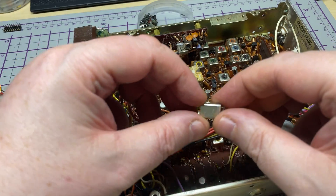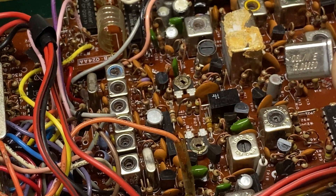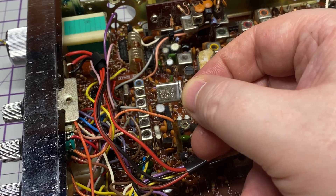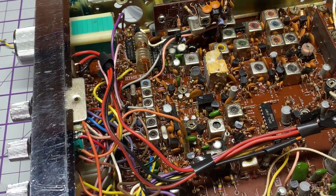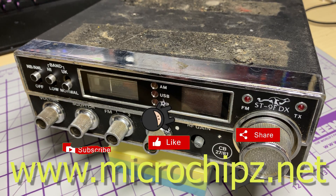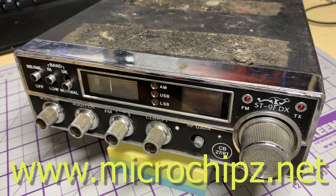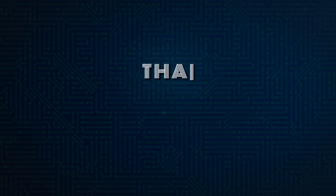But it's not transmitting and receiving where we wanted it to be. We actually found out that somebody's changed the main mixer crystal, so basically mid-band is now low-band, and high-band is now mid-band — so we've got no high band. Maybe those diodes were to shift it onto high band, but it's too late, they've gone. Stay tuned for part two where our struggle continues with this radio and how to fix this crystal problem — the crystals are not easy to get hold of. Don't forget to like, share, subscribe, comment, join the Facebook group, join the website — and thanks for watching.